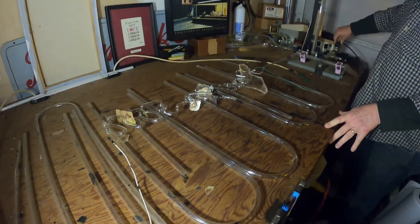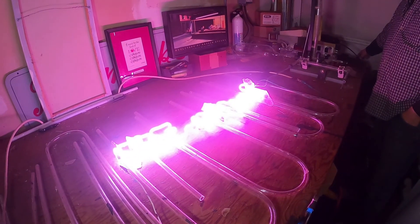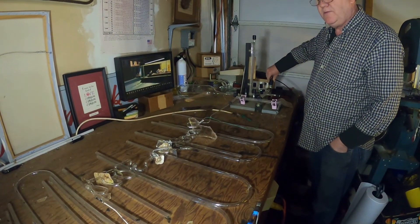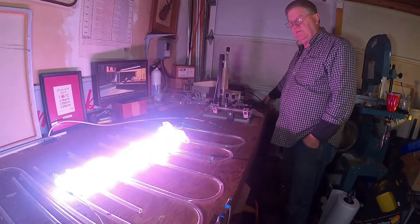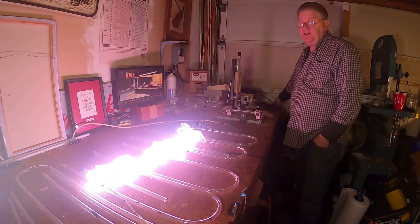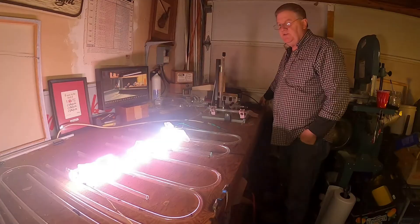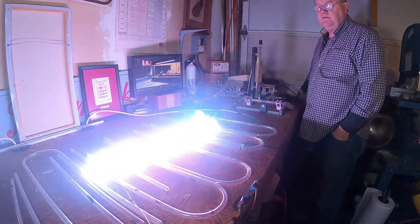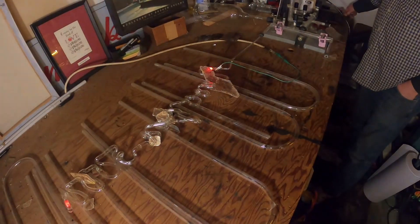You should see different colors in the tube — that will be oxygen, dirt, dust, whatever. We'll start heating that up. Put more vacuum on it. As the unit gets cleaner and cleaner, it gets whiter and whiter — that's actually the color of lightning in a bottle. If I left the high voltage electricity going too long, it'd actually melt the glass. You'll see the electrodes will start heating up on each end. You want to get those a nice red because the electrodes have been covered with a coating and you want to burn that coating off. Then we're going to let that cool back down to room temperature — it takes about five to seven minutes — and then we'll put the neon gas in it.